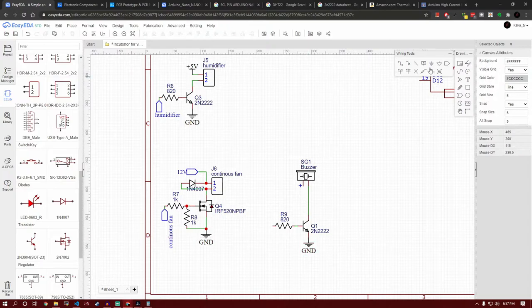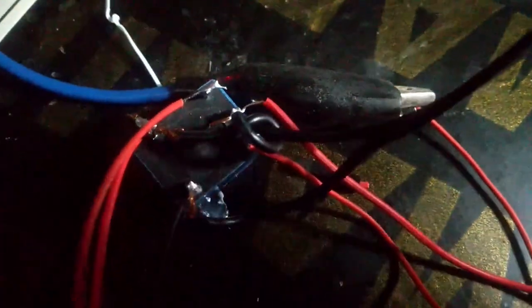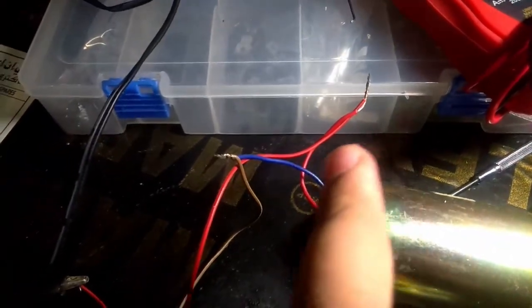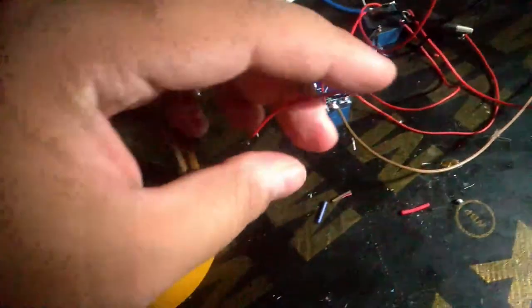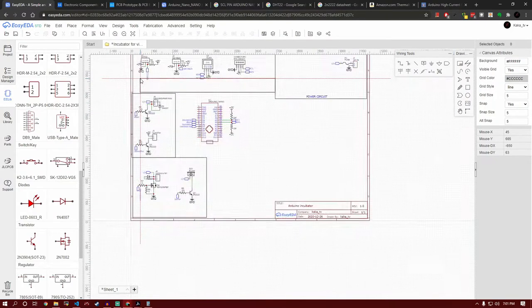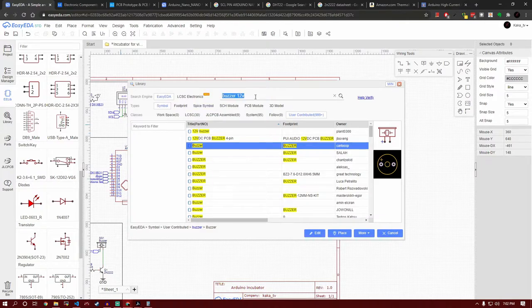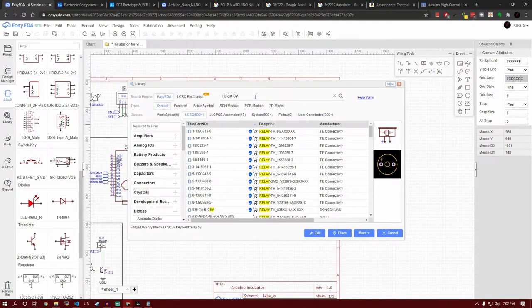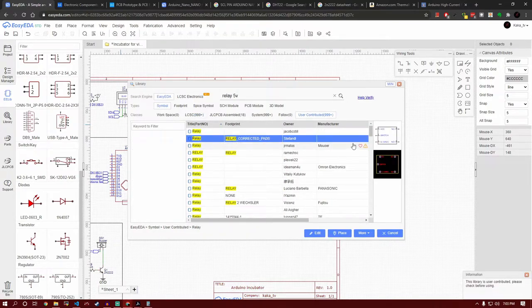Now let's make the motor controller. You might say I already showed this circuit in the previous video — the answer is that some places don't have fancy motor driver modules available in local shops, and some people may need to order from China and wait. So I found a circuit that's readily available at any electronics store almost anywhere in the world. It's a simple H-bridge made with two relays, and it can handle very high currents while being isolated from the rest of the circuit. Let's search the EasyEDA library for a 5-volt relay — one that turns on when 5 volts is applied to its coil and can handle AC voltage as well as up to 10 amperes of current.